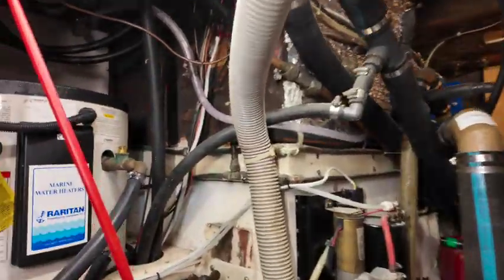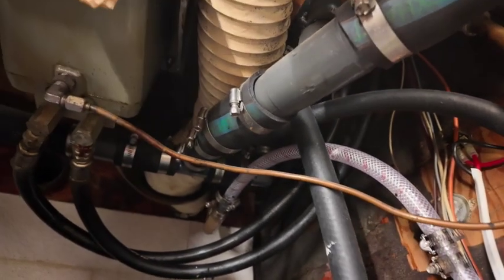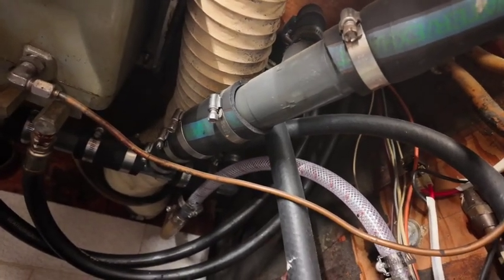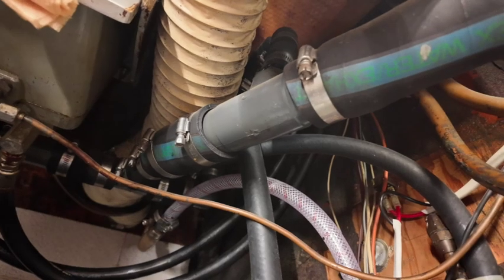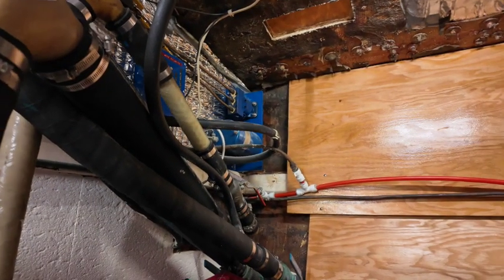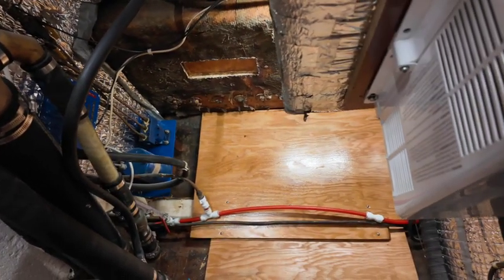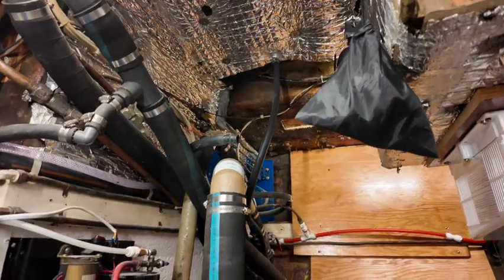After all those sizing difficulties, I found out that hose is three-quarter gray. I had a three-quarter to half-inch gray coupling, but the half-inch gray is actually five-eighths hose. Then I had the five-eighths hose, and I did have a five-eighths to half-inch white coupling going to half-inch hose going to that T over there, which is half-inch PEX, and then running along the half-inch copper. So we've got a fun plumbing situation on this boat — having a great time.